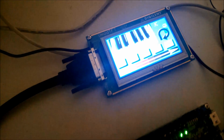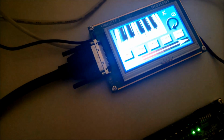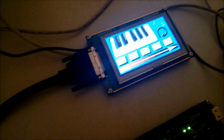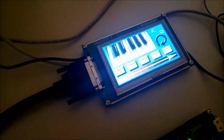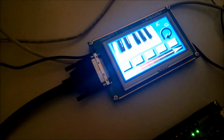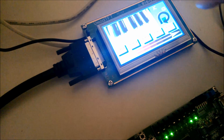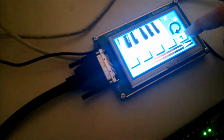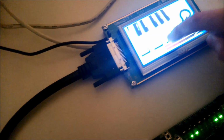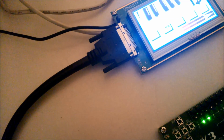So to implement looping on our board, we basically took the flash memory in the beginning, the first 20 seconds when the board boots up, and we dump it into DDR memory, and the DDR memory into the AC97 IC is a separate channel, so that can be driven independently of our sample channel. So we can activate the loop by pressing this button, while at the same time coming through the right channel we can trigger sample shots. And we can also do the keyboard algorithm where it does the frequency shifting.